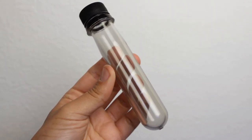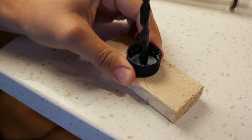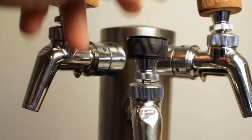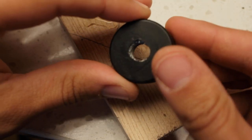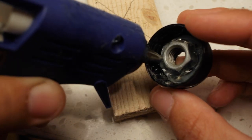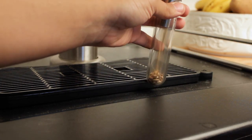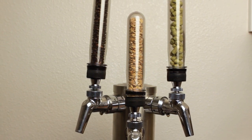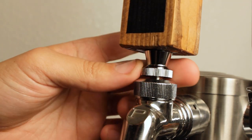Once you've used the yeast, take off the label — it comes off pretty easily. Then we need to make a hole for the nut to go in. This time I'll be using a drill bit that just perfectly fits inside the nut, and I'll drill into the cap from the inside with a sacrificial piece of wood below to get a clean hole. You may need to move your drill around to size up the hole slightly, and just double check that it fits onto your faucet tap. Next, affix the nut to the inside of the cap. Here I'm using a hot glue gun, which does work, but the bond is not as strong as epoxy, so if you have that I recommend it over hot glue. Just be sure not to get any on the threads of the cap or else it won't go on right. Don't worry if you mess up — the cap is just a 2-liter bottle cap, so you can always get a new one. Once the glue is hardened, you can now add in your ingredient of choice — a pale malt for lighter beer, some roasted malt for a stout, or some hops for your IPA. Get creative with it. One key tip on all of these is to use the collar — the part just below the tap — to tighten down and make sure the handle is secure, since there aren't as many threads for it to hang onto.